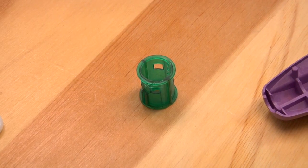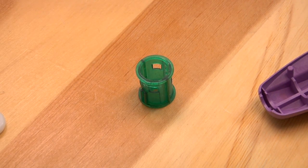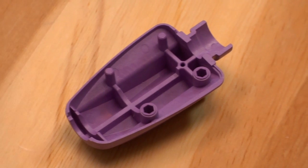These printed molds we clamp with about four to five tons of pressure, so they don't flash. We don't have to trim parts when we're done — we pull them right out of the mold and ship them. The material is very good under compression. But to do a part this thin and this long, even in metal, would have been extremely difficult.